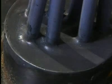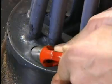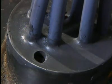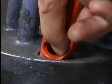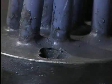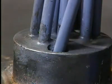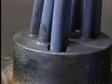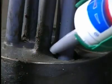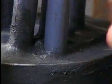An important advantage of the RISE system is the ability to add or remove cables at a later stage without disassembling the whole penetration. A hollow punch is used to push into the 20mm sealant layer. The removed sealant remains inside the punch to create an opening for the new cable. Remove as much sealant as needed on both sides to allow the new cable or cables through the penetration. The new cable is pulled through an empty sleeve. FIWR sealant is used to seal the free space around the cable and is then smoothed in the usual way — it's simple, quick and cost-effective.